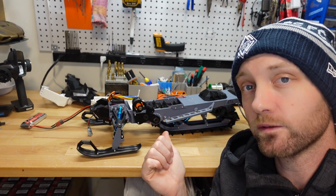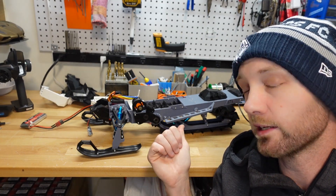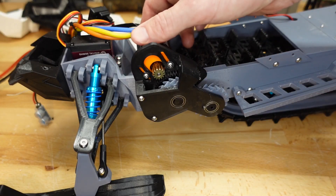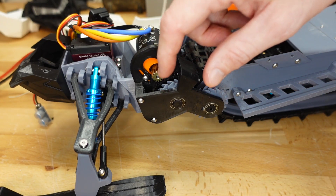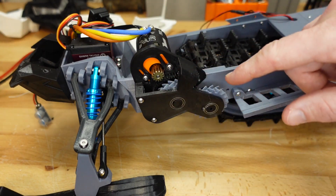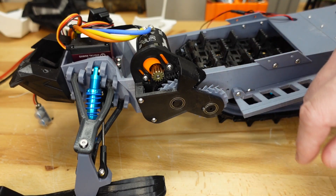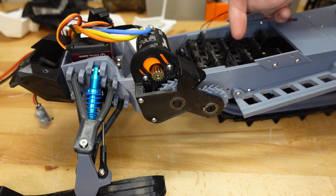There are a number of different ways of doing this, so each to their own and do what you think is best. But this seems to be one of the ways that's definitely most common and most foolproof. The original ski drive transmission works with a pinion gear which meshes with a Traxxas spur gear, which is then attached directly to a herringbone 3D printed gear that matches to another 3D printed herringbone gear. This one is keyed right onto the drive shaft, which has two sprockets on it — that's what drives your track.